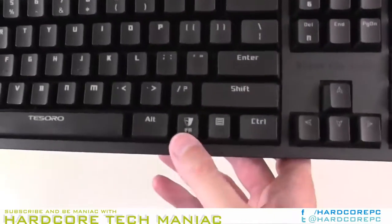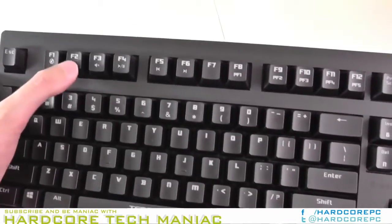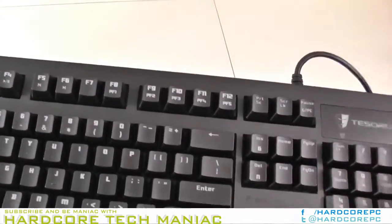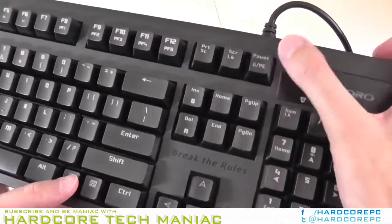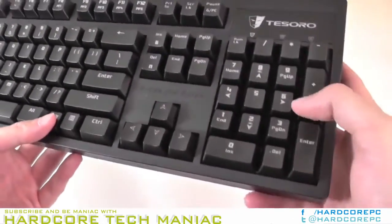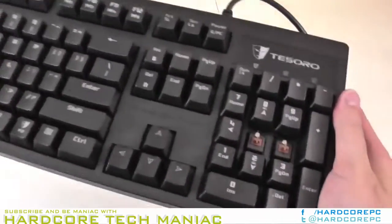There is a metallic leaf inside the Gateron optical switches as well anyway, but it is there only to emulate the movement and feedback of the mechanical switch. Even though the Gateron blue optical switch does copy the regular mechanical switch in terms of force, the infrared sensor actuates and resets the switch at a specific travel point, ignoring the state of the metallic parts. This specific behavior can be very useful to gamers, as the switch does not have to reach the actual reset point of the classic mechanical switch variant that is almost 1 mm above the actuation point, making rapid and continuous keystrokes easier and more reliable.